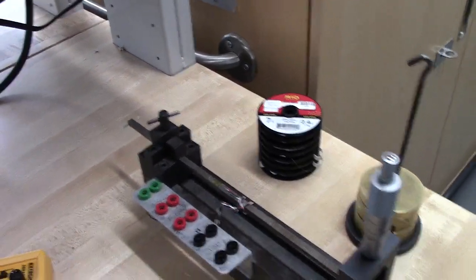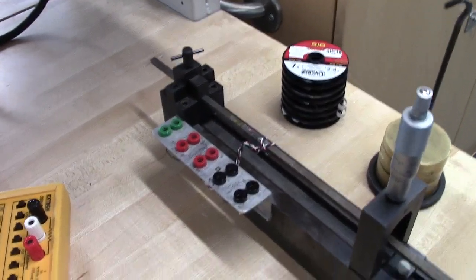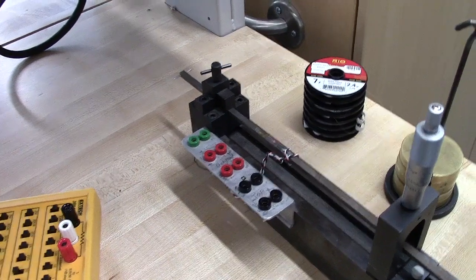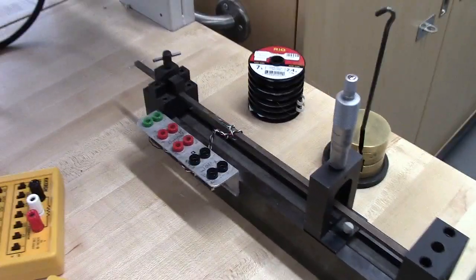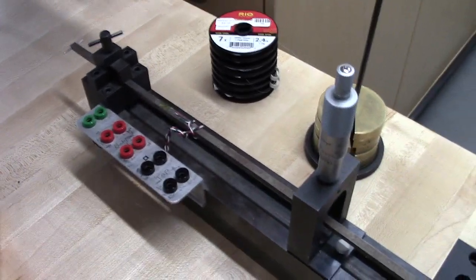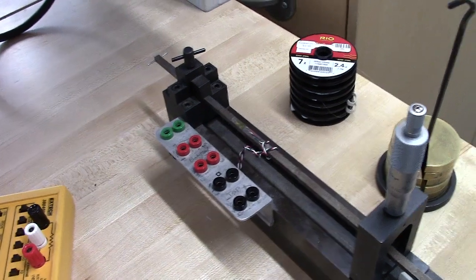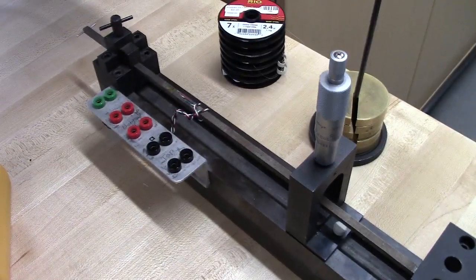Just look at that side of the bridge, the Wheatstone bridge, and do the calculation, the Ohm's law for the 2 resistances. Remember, strain gauges are resistances. So we know the resistances of those. That's given to you in the lab handout text. I'll tell you right now it's 350.